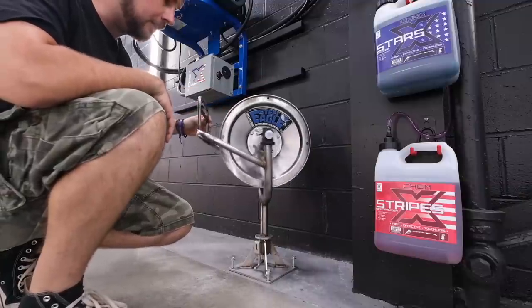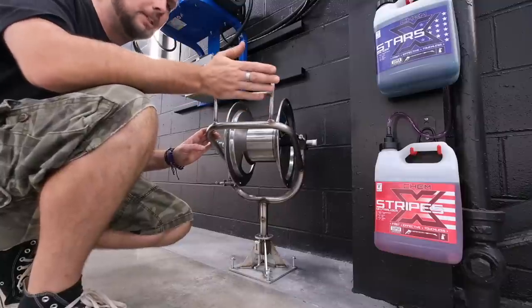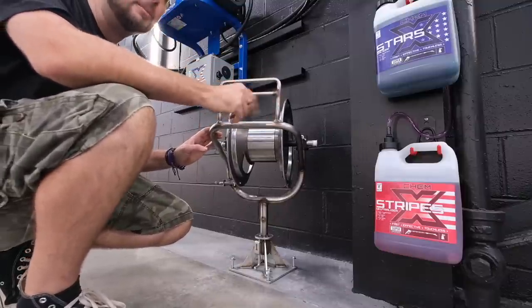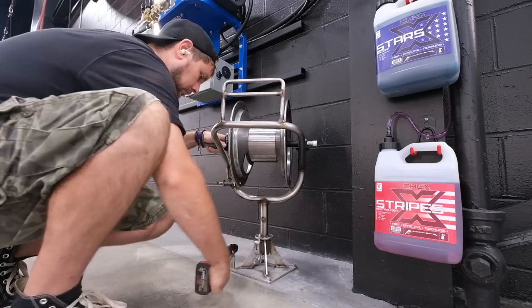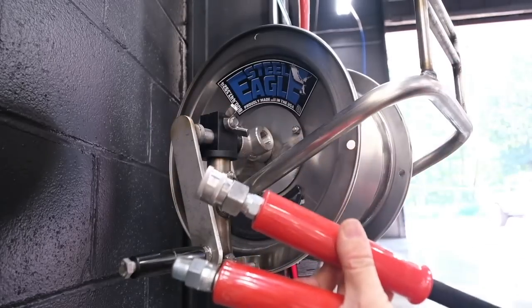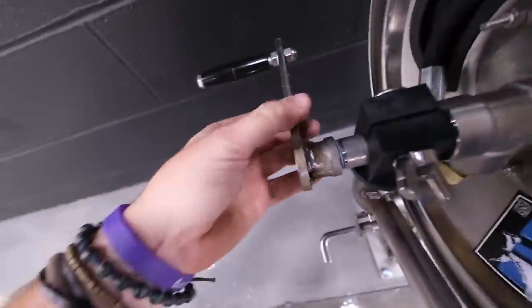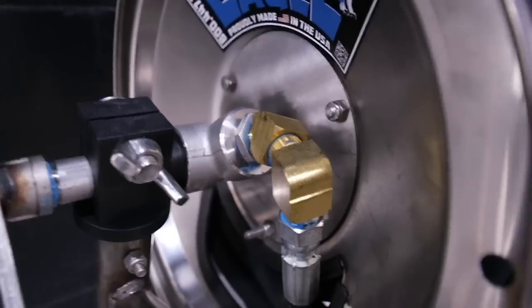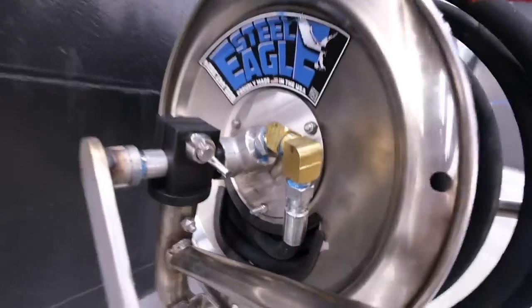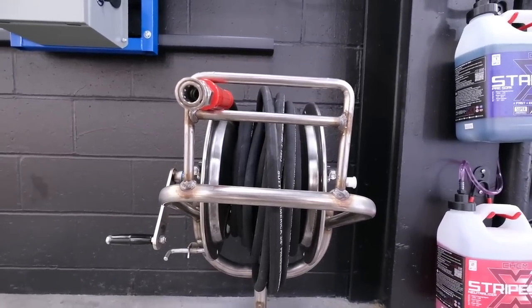So I got this little 100-foot stainless steel reel, and I already drilled out the holes — these are the anchors for the floor concrete. I wanted to put maybe an undercarriage washer on this thing, or just have the reach for this machine to go 100 feet away from where it is, so that it's not limited to just that ceiling boom. I always put the swiveling side on the reel because you're going to need to be able to turn that. The other side is going to have a high-pressure swivel on the gun anyway. So I got it all installed, and I've decided that this is the single worst hose reel I've ever worked with, and I want it gone. This is horrible welding — it's welded on crooked. The port for the hose, you can't tie a hose onto it. The hose sticks straight out into this barrel and it can't make that kind of a turn. Even if you could get into that port, it would chafe on this lock. The final clincher is that the entire face of the thing is welded on crooked. I can't handle that — this is going bye-bye.